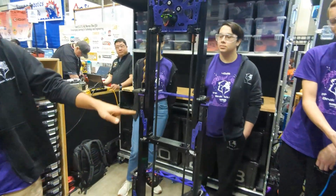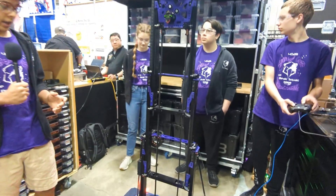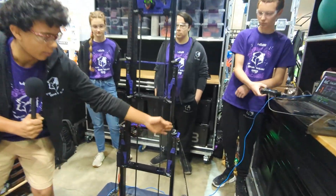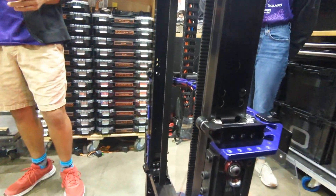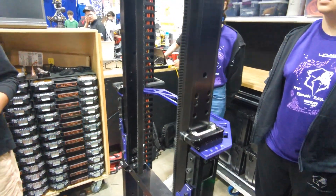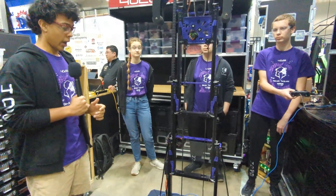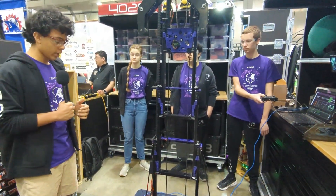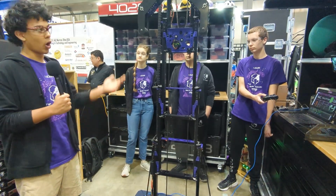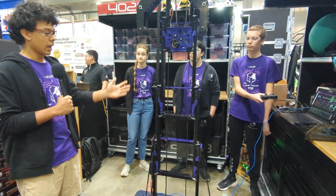The second big point of this elevator is manufacturing and serviceability. There are carefully calculated holes — for example, on each stage wall there are specific holes to access every single screw on this elevator for maintenance, which really extends its lifespan. All bars are anodized and machined in-shop, which required building in tolerances. A lot of work went into precision cuts so that the elevator moves smoothly but not loosely — when all the way up, they don't want it to wobble.